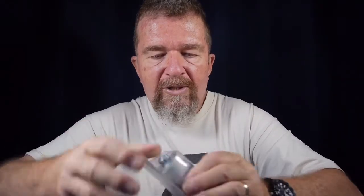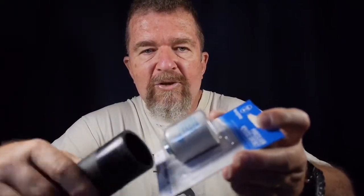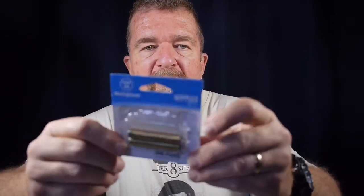I got a porcelain electrical socket — I didn't want the kind with the switch because it sticks out the side and won't fit inside the tube, but the porcelain socket will go in there and the light bulb fits on the socket. I'm going to need a way of attaching the back of the socket to the PVC pipe using these threaded pipe nipples — that's what they're called. They come in different lengths and you use nuts to secure them. I'll drill a hole in the back cap, run the pipe nipple through there, secure it with nuts, and the electrical cord will run through that nipple onto the light socket, which will be on the front.